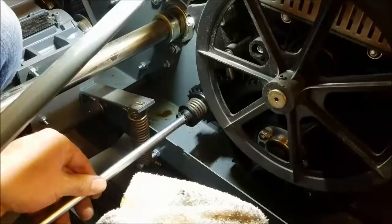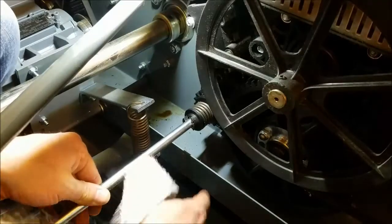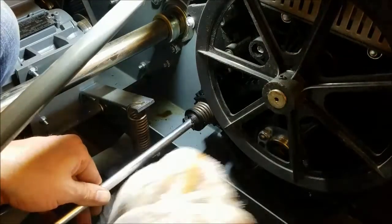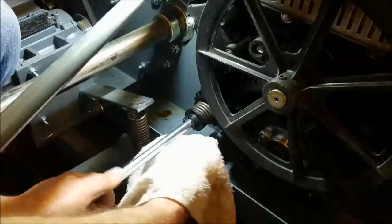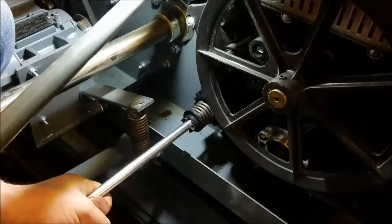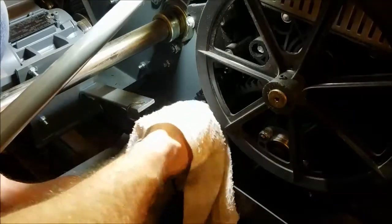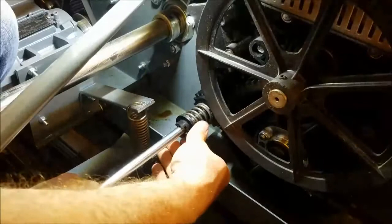Now this is free and spinning right now, so the first thing I do is engage my gears so we're solid. The other thing is this plastic is just kind of sharp — doing one machine is not too bad, but after four or five you'll really appreciate the rag. So I'm going to take my rag, push in and turn clockwise. Now I'm on the first position, and I'm going to push one more time and now my assembly comes apart.